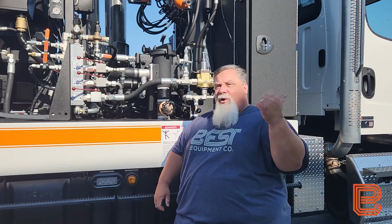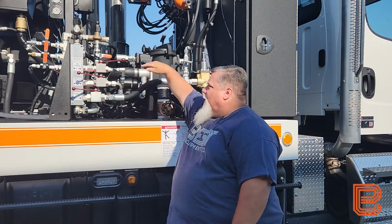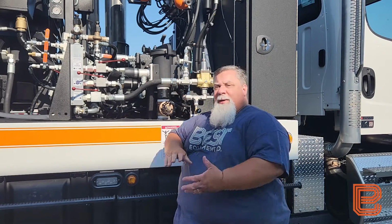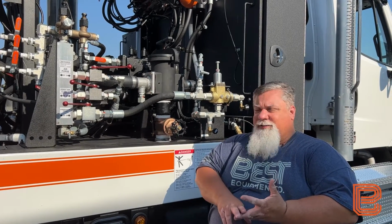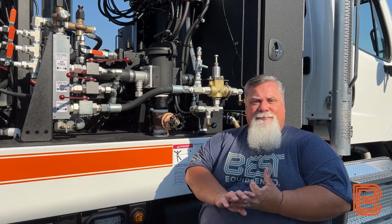So with our pump control on the front in the off position, we're going to open our air purge ball valve. So we now have air flowing over the exhaust sections, and we're going to start the water pump assembly. Depending whether you have a single engine unit, a dual engine unit, transfer case unit, these are all started through different procedures that we'll go through in another section.